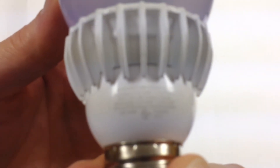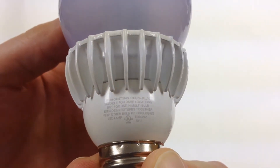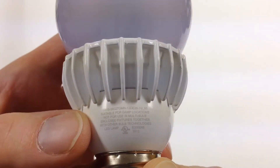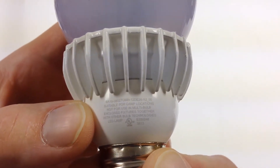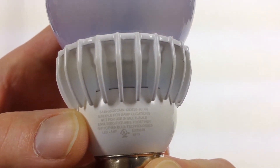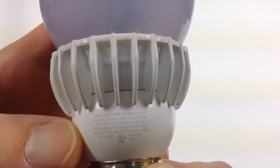I'll finish up this section with a look at the label in the neck of the bulb — good to know what it says so you can figure out what you installed many years ago, hopefully a decade or two down the line when it comes up for replacement. It should be clear on suitable use locations. It says not for use in multi-lamp fixtures or enclosed fixtures together with other bulbs. It's not entirely clear if it should never be used in an enclosed fixture, as it doesn't talk about temperature range here. It does say it's suitable for damp locations.